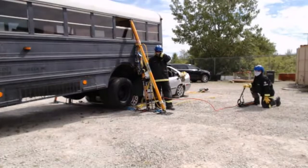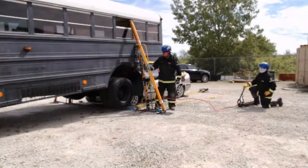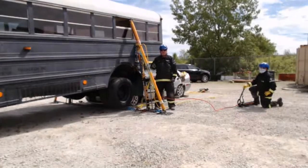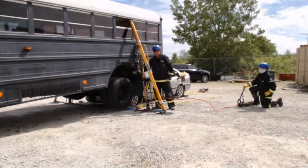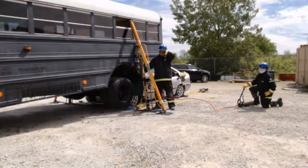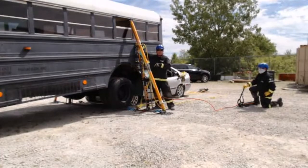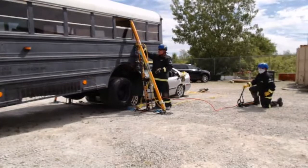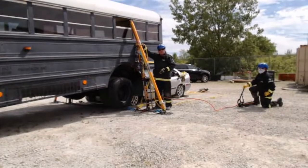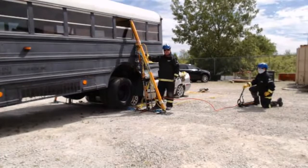So with my hydrofusion in place, my chain in place, I'm using a new chain configuration that we are trying out. This one's a half-inch chain, but the half-inch chain on the inside, I've got what's called a frame hook. So basically, that's all I did with this. I reached in and I hooked the frame. The nice C-frame that's on these heavier vehicles, I hooked that, brought it up, brought it through my multi-chain head. With that, I could drag the chain, and it tightens the chain up. It drops back to a default link. Then I spin my collar up to tighten in place.